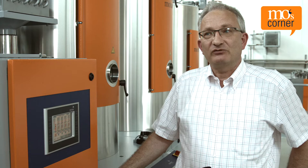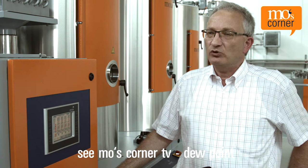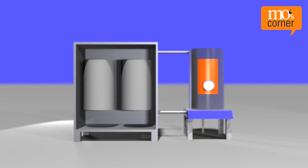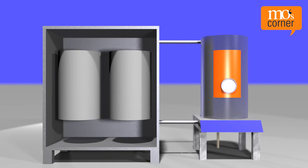The second functional unit is the drying silos themselves, in which the granulate is changed from a moist state to a dry state. The dry air unit contains a special desiccant which reduces the humidity to such an extent that we can achieve dew points in the range of minus 26 to minus 40 degrees. The dew point used depends on the requirements.